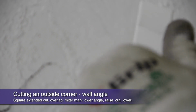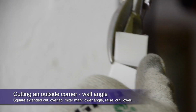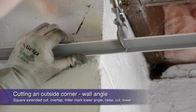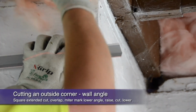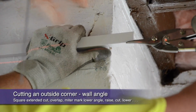Your outside corners require a little more attention, but are still easy to achieve a clean mitered visual. Simply let the angle override past the corner, then square butt cut to length. Next, you want to cut away the vertical flange, leaving an exposed horizontal tab. You will do this to both angles that approach the outside corner.